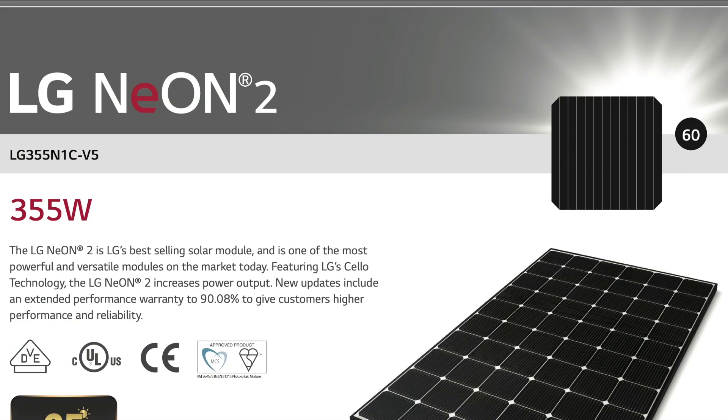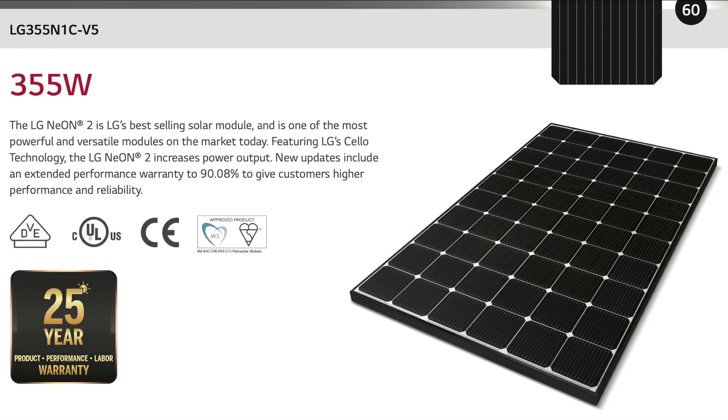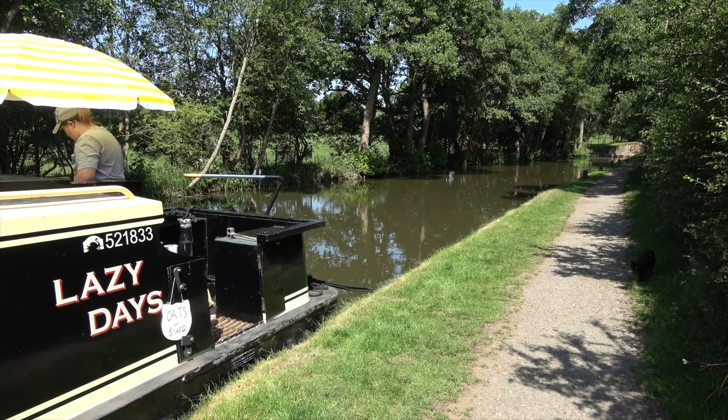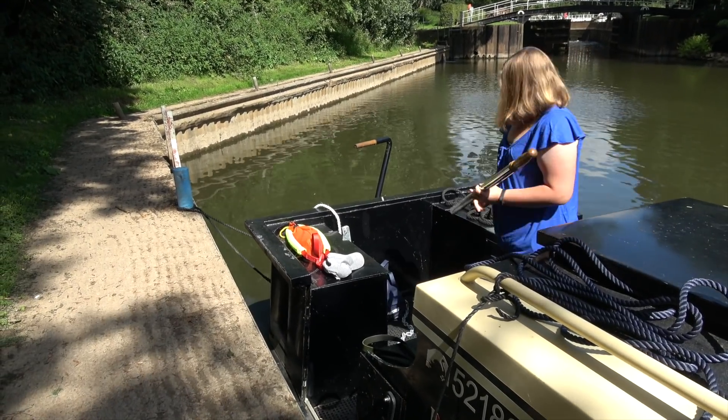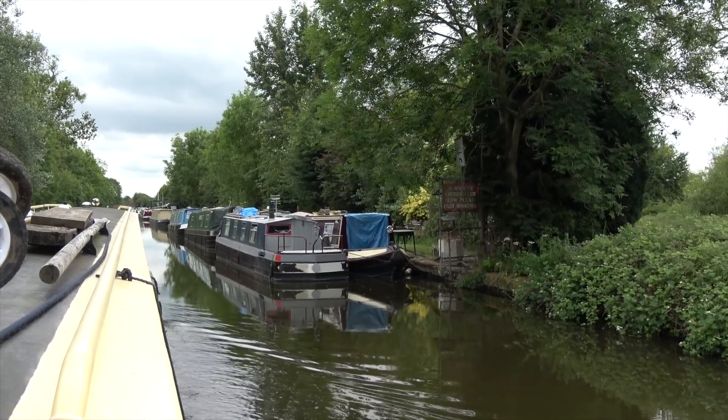It's important to note that the wattage value assigned to a panel is best case — in optimum conditions with perfect sun, a 100 watt panel will give you 100 watts. On a narrowboat in the UK with sketchy weather and trees along the canal, your chances of getting peak performance aren't that great. You're looking at getting 70 to 80 percent of maximum capacity in optimum summer months, so bear that in mind when working out how many watt panels you need.